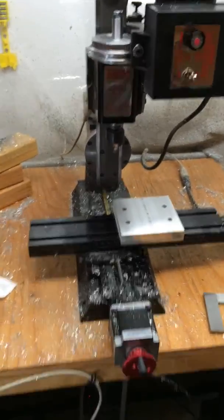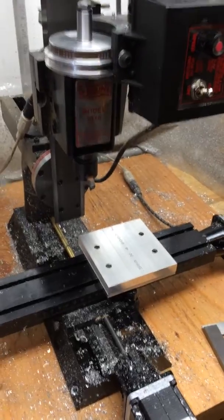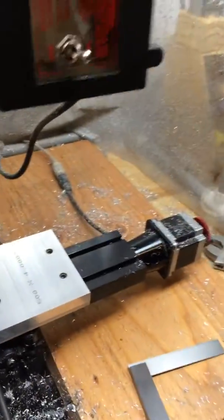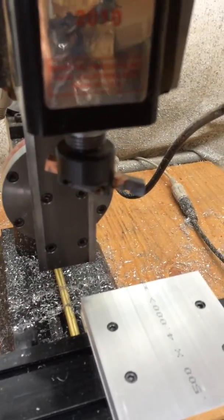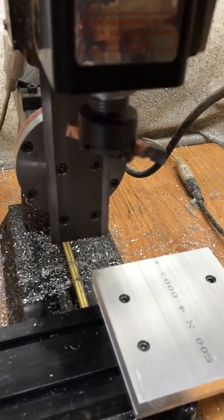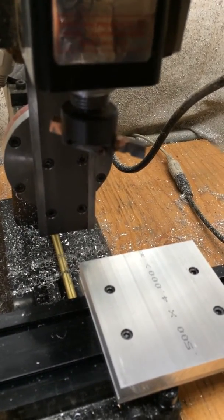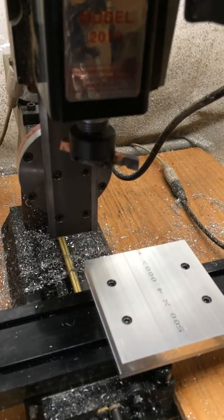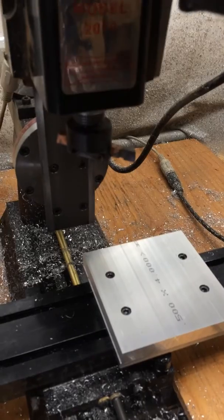This is a video on the setup of how I'm fly cutting the top part of the molds that I'm going to make. One of the things about the fly cutter is that it's basically this little carbide tip that flies around and can actually take a sliver of the surface of the metal off. That arc is fairly large, so you can take a fair amount of material in one swipe, and you can also get a pretty nice finish with it.